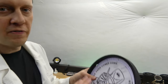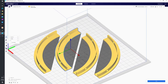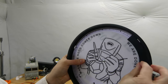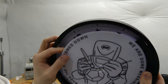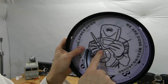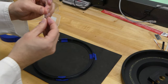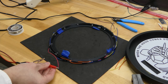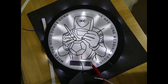My printer wasn't big enough to print the entire face of the clock, and that's okay, because I'm going to be using these standoffs which have holes cut into them for LEDs. The plan is to set these standoffs behind the face and backlight it. This also gives me hopefully enough room to put electronics behind it, like LEDs for the welding effect. When wiring up the LEDs, just note that there is a flat side of the LED bulb — this is where the ground side is. After fitting all the LEDs, I did a quick test to ensure they are still working. This is a preview of the backlight effect and it's looking pretty good.